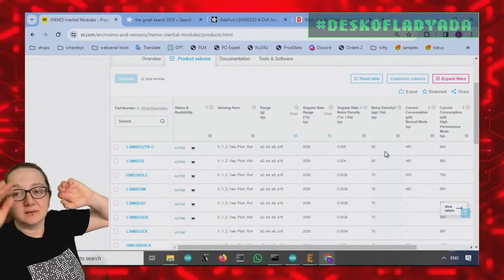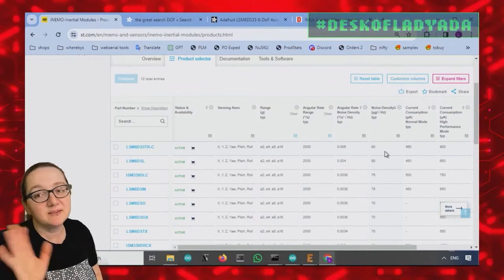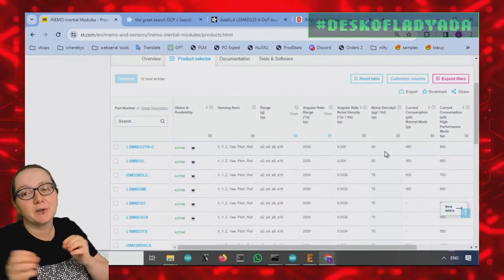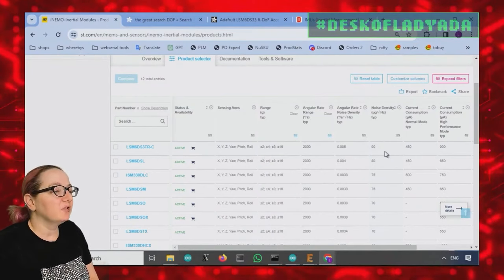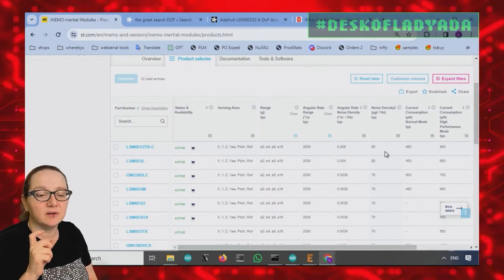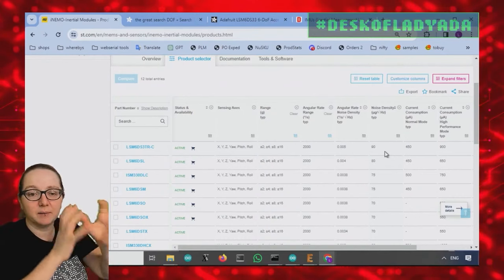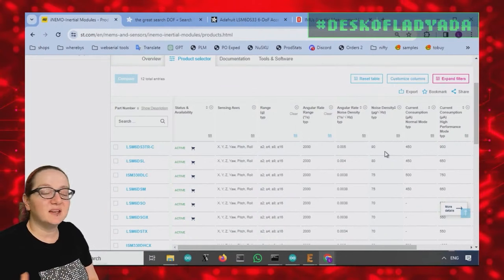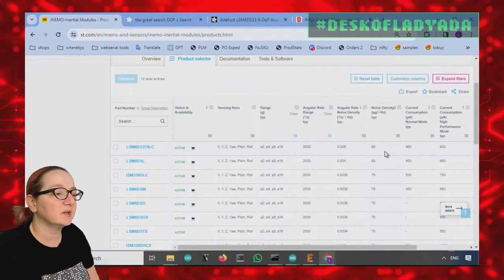Because of what makes these accelerometer gyros expensive. First off, accelerometers cost like nothing. Accelerometers are very inexpensive for the most part. This has been figured out. MEMS accelerometers, there are some that are a little bit better, they might have better filtering, but the technology is well established and the quality is well established. Gyroscopes, what you're going to deal with is noisiness and drift, because that's what's going to introduce the most error into your calculations when you're doing 9-DoF attitude calculations or absolute orientation calculations. The higher the noise density, the more you're going to see wiggle and drift, as things start moving when they should be still.